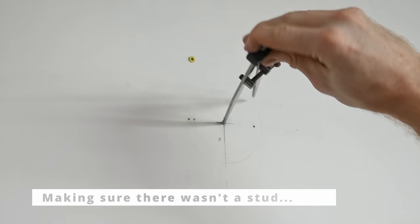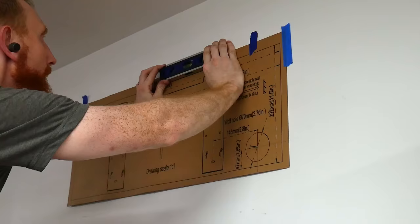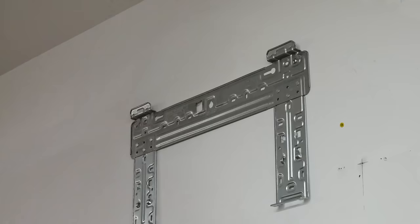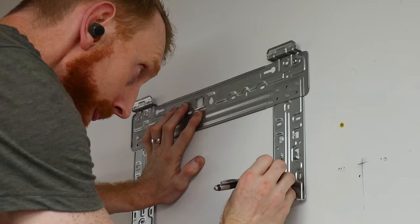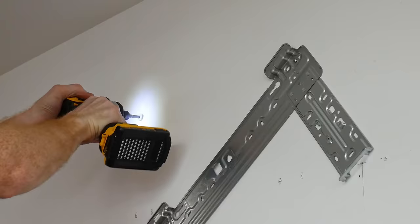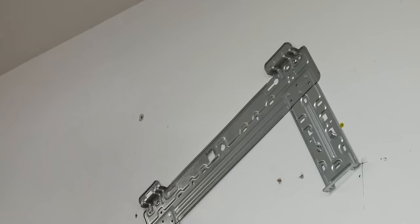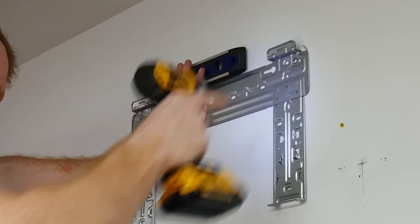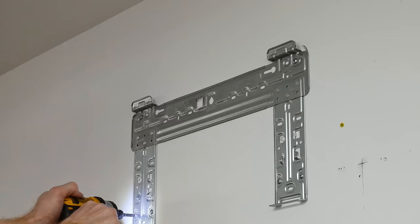When it comes to mounting the inside unit, I started by marking off where I want my large hole to be. I used a small drill bit to penetrate through the cardboard and into the center of the hole location in my wall, which allowed me to locate the first mounting hole of the bracket accurately. I then mounted the bracket with one screw, leveled it, and marked the remaining hole locations — I figured I could get a physical bracket more square than a piece of cardboard.